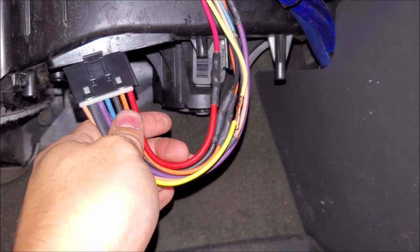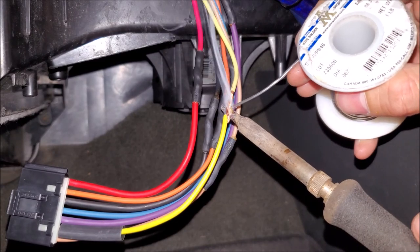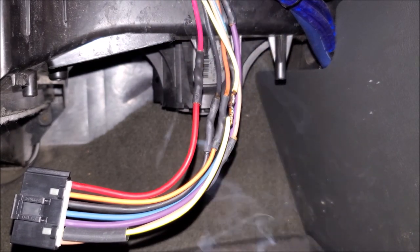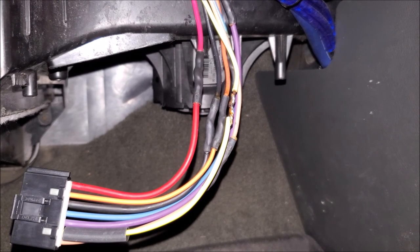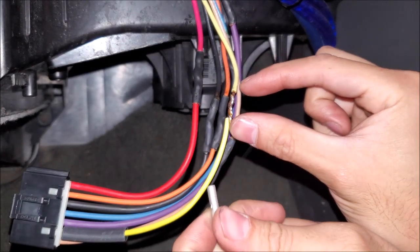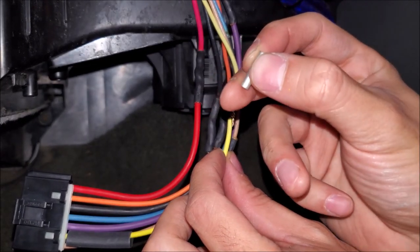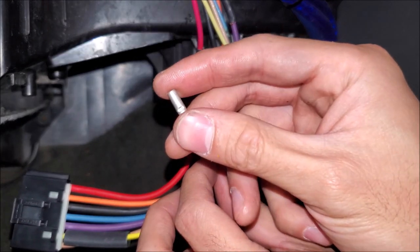Verify it's going to be in the right position, then go ahead and hit it with the solder. I prefer soldering. I don't live in a climate where it gets super cold — if you're hitting negative 40 degrees Celsius, you might want to consider crimping instead. But look how much more surface area I have as a contact patch with soldering. In a connector, you're at the mercy of whatever pot metal it's made from — I know this is copper.